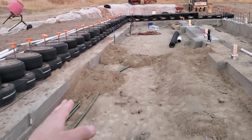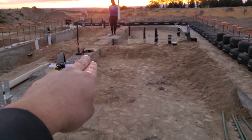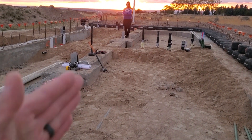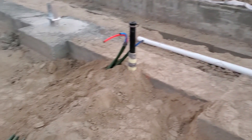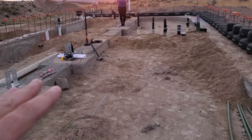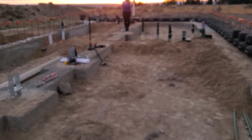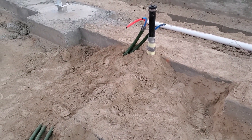We've got a whole bunch of poly lines coming along here into the kitchen area. The kitchen has no gray water or anything happening, so that was pretty straightforward. This is where the kitchen sink will be — just draining, going into here, under the sleeve that I buried before all the concrete work happened, and then out that way. The plumber said the sleeve that I buried was perfect, which is nice because I spent a lot of time making sure it was at the right elevation — a quarter inch of elevation drop per foot of distance — and getting it lined up. And it did work, which was really nice.